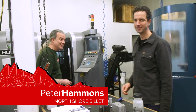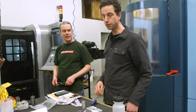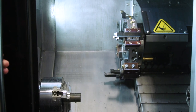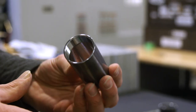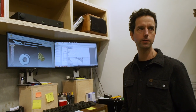This is Peter, a machinist. He's making bottom brackets today on the lathe — threaded bottom brackets. Making bottom brackets is pretty simple: we take a raw steel tube, cut it to length, put it in the chuck where it gets turned. We do an internal bore and then thread it. Year after year we've been designing our own tubes, opening molds with tubing manufacturers, and now every tube on every frame we make is entirely our own design, our own mold, manufactured exclusively for us.